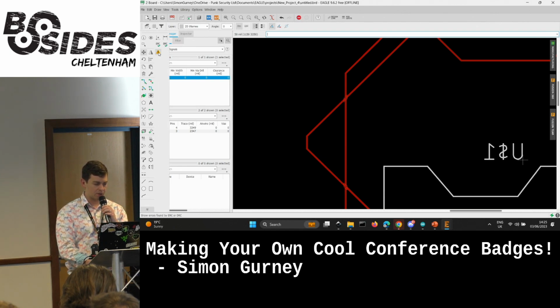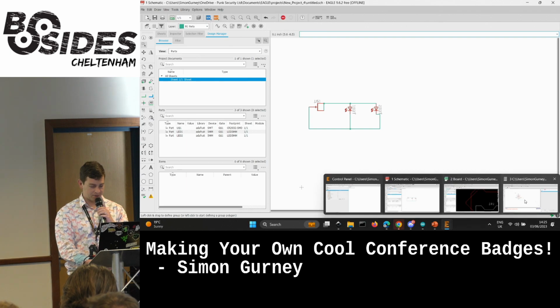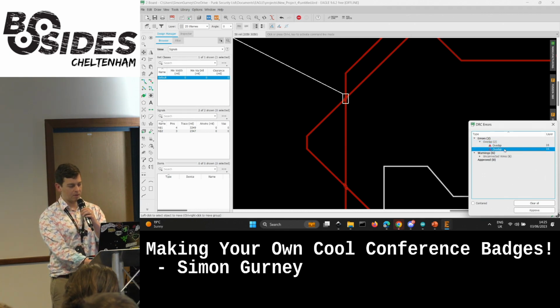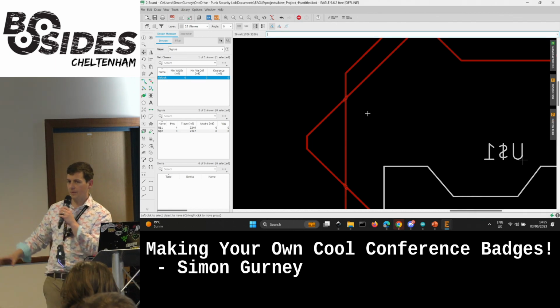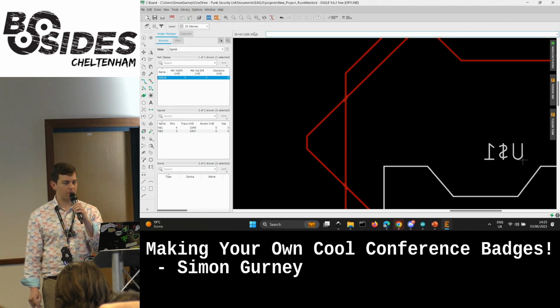And then when you go to actually do this thing, there's an error checker. Oh, that's just moaning because my schematic's terrible. Let me find a different one. Overlap. There we go. So this is where you want to be looking to say, oh yeah, this is overlapping in these two places. It moans at this. When you're going to send this to a PCB house, you've done all the hard work now. You need to get it to a PCB house. You use this CAM processor up here. Oh, I need to set it up. And that would moan as well to say that there's errors on the board. Are you sure you want to do this?